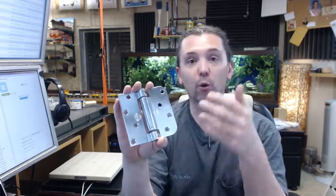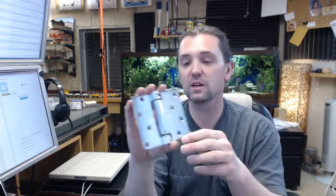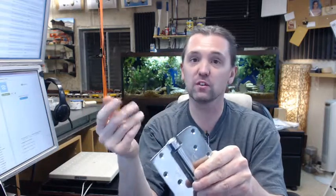I've found that when a door is underpowered in terms of how many springs are doing the job, or if the door is too heavy for the quantity of spring hinges, or if the conditions are such that the door doesn't have much of a chance of closing, you will have an intermittent sort of success rate with the self-closing and self-latching. Spring hinges are good with the quantity of energy they have stored when the door is open at 90 degrees, but if you don't have enough residual stored energy when the door is in its closing or latching cycle, you may not get the door to actually latch — it's overcoming wind resistance, air pressure, and the friction of the latch striking the strike plate. If you've got one spring hinge and you should have two, or two and you should have three, you've got to crank the tension so high just to get the door moving quick enough through the closing cycle to have enough inertia left to get it to latch.